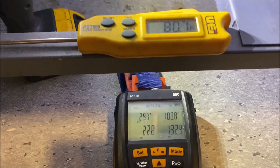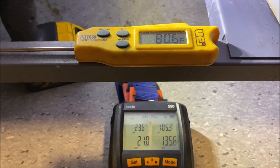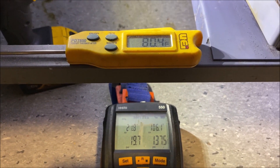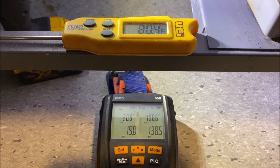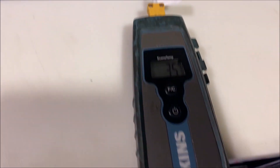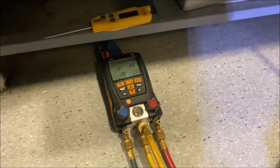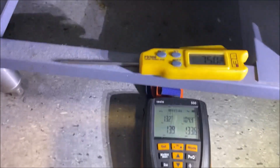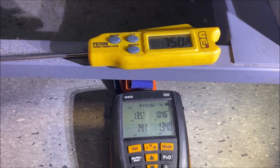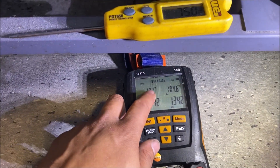Our ambient temperature is going to start dropping nicely now. We're not going to run at 80°F — hopefully a little bit lower. Let's let the Viper do its thing and see what temperatures we end up with. We're at 35°F box temp, and our ambient has dropped down to 75°F. The whole area underneath is a lot cooler, and we're at 104.6°F condenser saturation.